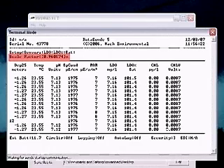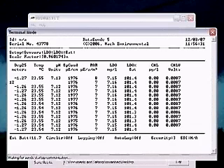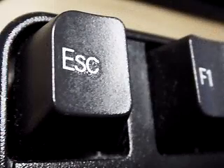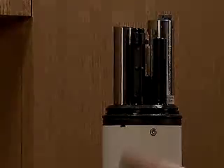Highlight LDO % SAT and press Enter. Read the Scale Factor. A valid calibration will produce a scale factor between 0.5 and 1.5. Values outside of these parameters may indicate a problem with the sensor or electronics. Do not type a new value for the scale factor, as this will invalidate the calibration and cause the sensor to take incorrect readings. Press Escape after you have verified the scale factor is acceptable. Your LDO is now calibrated and ready to deploy.